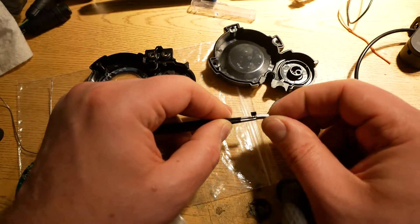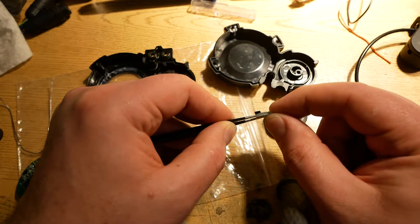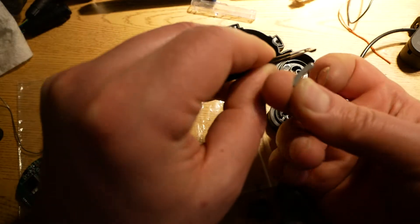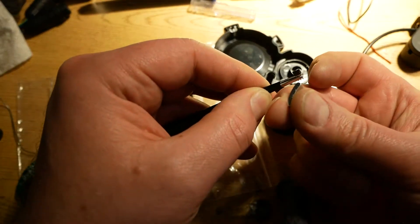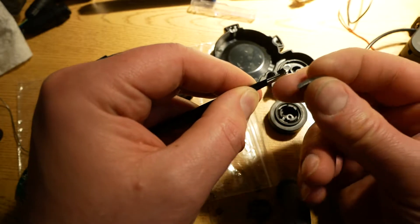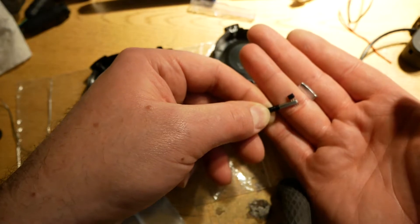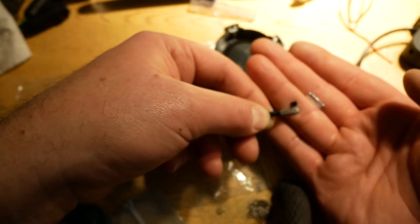Let's say this end of the magnet is the south pole and the other end is the north pole. The south pole will pull the hall down to about 0.6–0.7 volts. About in the middle, the north and south faces are balancing out, so it puts out about its median voltage — around 2.4 or 2.5 volts. When the north pole is around to the hall, it outputs its maximum of about 4.0–4.2 volts. All you're really doing when you pull the throttle is rotating a magnet from south to north in front of the hall. The output leg changes its voltage based on magnet position. This is literally the two key components in every hall throttle on the planet — a magnet and a hall sensor.